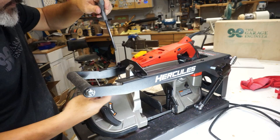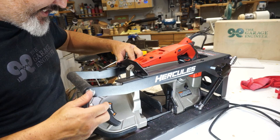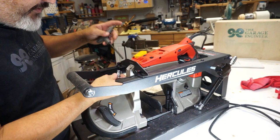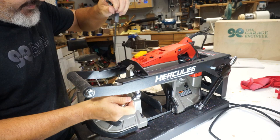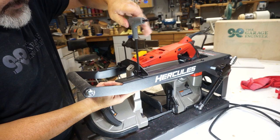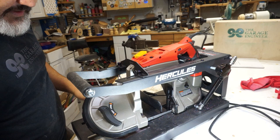The blade on this was not too bad — I'm just going to tweak it a little so it's more in the center. There's no right or wrong answer; it doesn't have to be perfectly one way or the other. Just get it close to the center and tighten it down, tighten this side down too. Now let's check for square. I don't have my machinist square with me, so we're going to use the end of a combination square without the ruler on it.